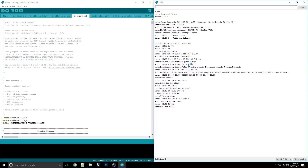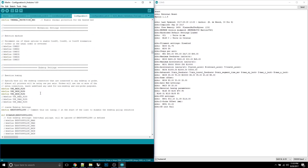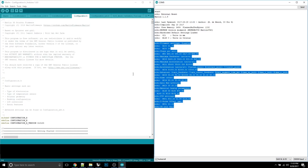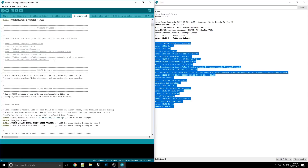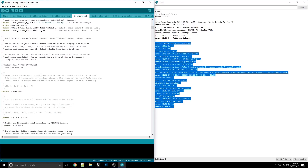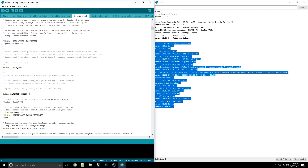The reason we need to run that M501 command is because it gives us the printer's stock values — what the manufacturer determines are the best values for your printer. Over here in firmware, we can scroll down to — for example — default max acceleration, and that is where we get our values to plug in. I'm not going to go through each of the values — I'm just going to swing through this quickly. Starting at the top: we don't need to mess with any of this because it was already set up for us since we selected that example sketch.